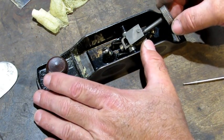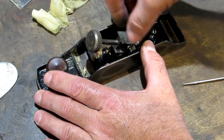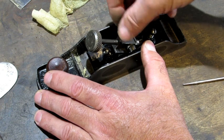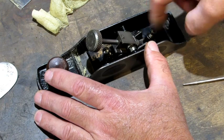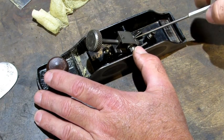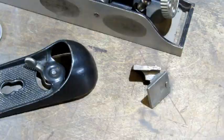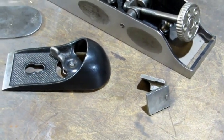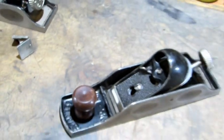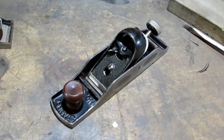But when you try to flip it over to go to the bullnose position, it will not rest back into the spot where it's machined for that frog to slide up and down. I can't back it out anymore without it coming out of the threads that hold it in place. I've turned it over and tried both sides and it doesn't work in the bullnose position. So I'm totally baffled. After personally seeing two broken frogs and having broken a frog myself, I'm giving up. I'm going to give this thing a test drive in the block plane mode and not going to be able to do bullnose.